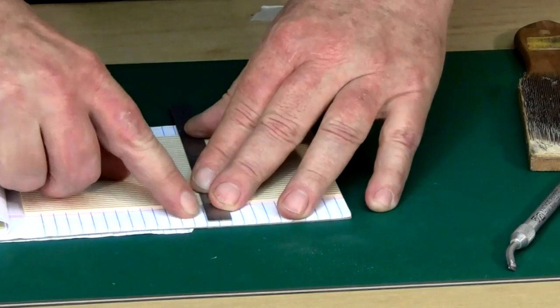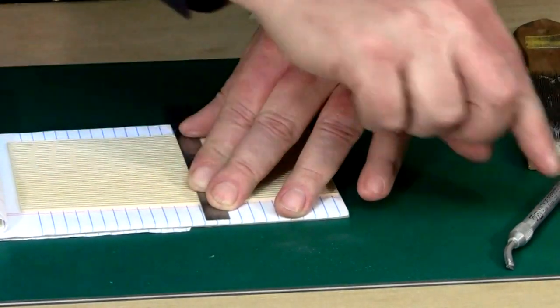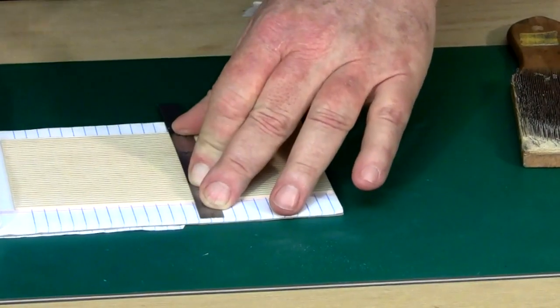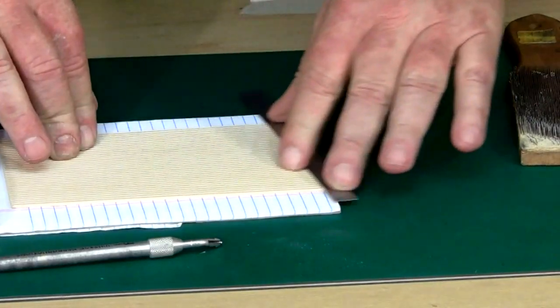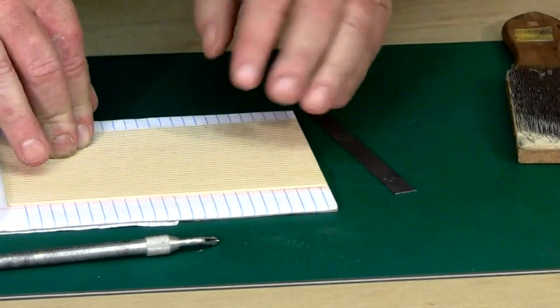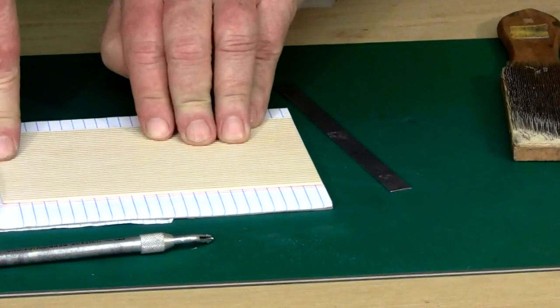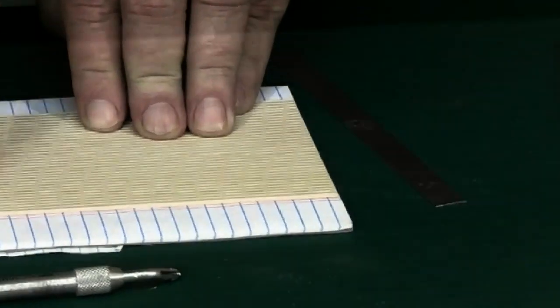As long as you're over the line here and over the line there, you'd run the Pounce wheel just as Jack had shown you, and you'd be able to get automatic perfect spacing with not a worry in the world about having them come out crooked, because as long as everything remains square on the piece of paper, your nail hole lines will be true.